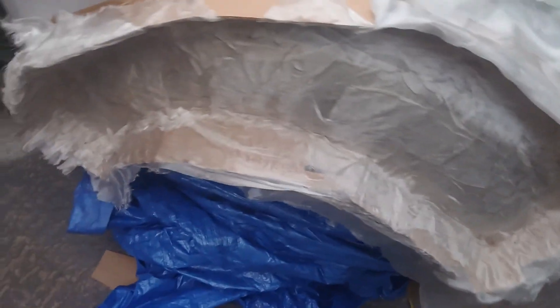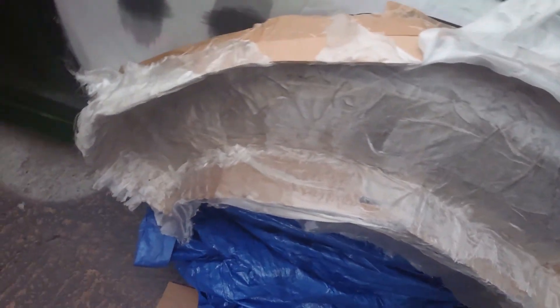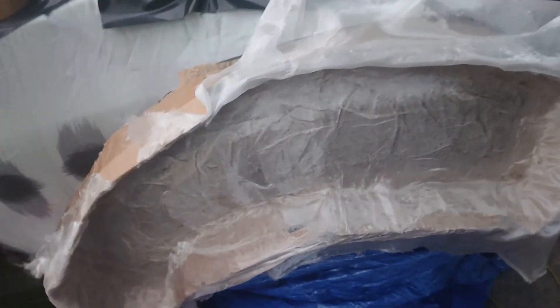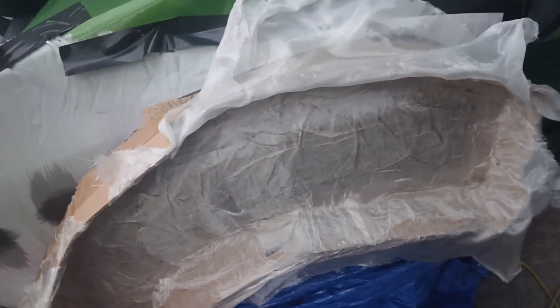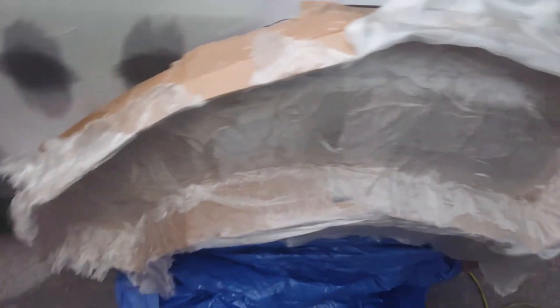This is just going to be the mould, and basically from the other side is where you're going to be putting the mould. We can always smooth that area, which should be flatter because it's using the black tape. I wouldn't worry too much about it at the moment. Next job is to obviously let that dry out, then we come back tomorrow and put the fibreglass down. That will give it its strength. We can also put some metal in there and use the bondo and the resin to set that in, just to give it some more rigidity. We'll do that tomorrow.